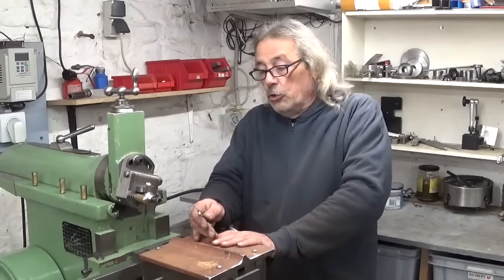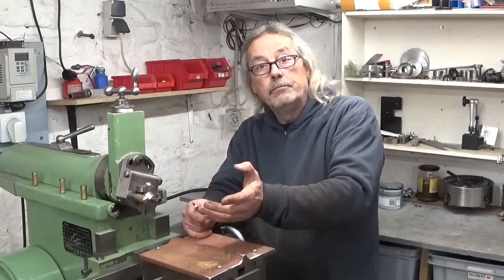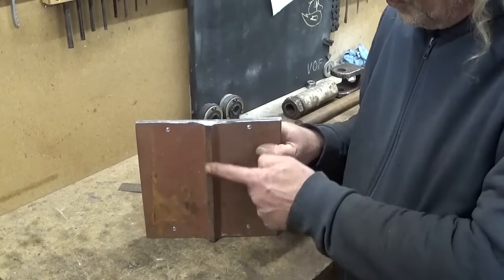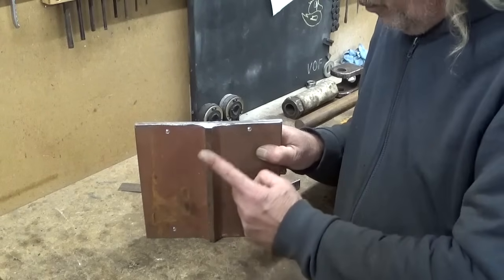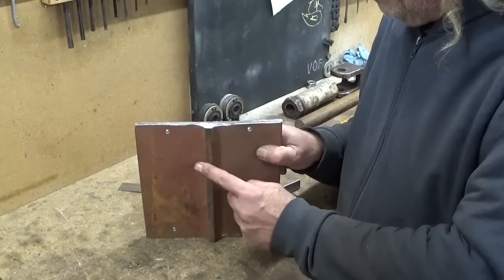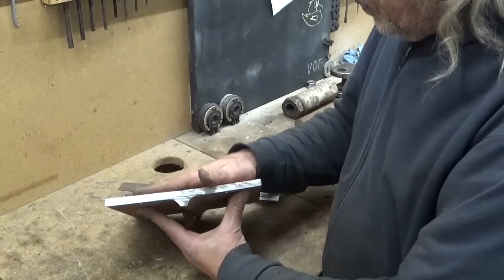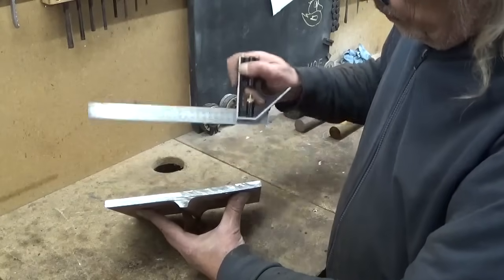And this is also where I see my first little problem. Of course I fixed them on the shaper to cut off this leftover of this beam thing here. But that is not a problem at all. The problem is that this face is in a bow, it's concave.